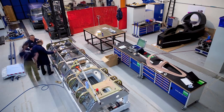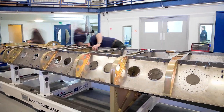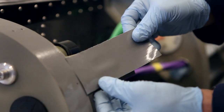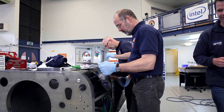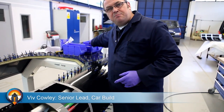Let's take a closer look at the rear lower chassis. Working on a large assembly fixture, which keeps everything true, the engineers glue and rivet machined aluminium pieces to steel sheets. We lay the glue film on top, we put that panel on and we locate it with these devices — they're called skin pins.